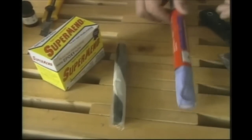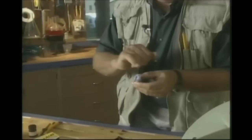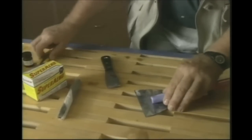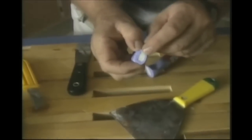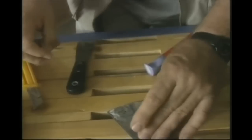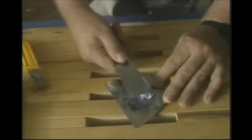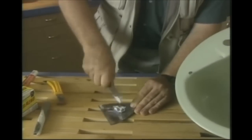The proper way to do it is fill first. The proper material to use is an epoxy putty, which comes in many different brands — some are striped to show the two-part epoxy, others are molded within a cylindrical tube. All you have to do is cut equal quantities. You've got the inside hardener and the putty around the outside. Knead it together using a putty knife, and you'll have a good putty to fill the cavity.